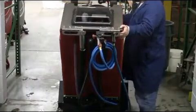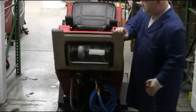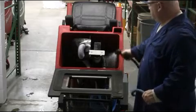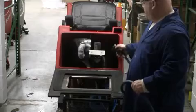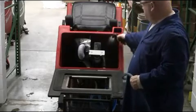Your GTX's solution tank can be leaned back once all the recovery and clean water solution has been drained. Simply lean the tank back accordingly — the tank is safely supported by a safety lanyard. Next, open the recovery lid and thoroughly rinse the recovery tank with the drain hose in the open position. Once all the dirt and debris has been cleared from the tank assembly, replace the tank in the upright position.